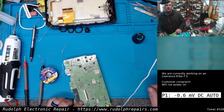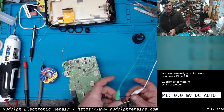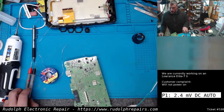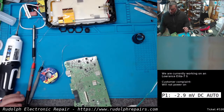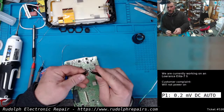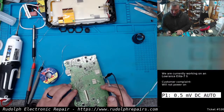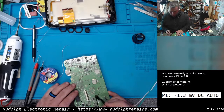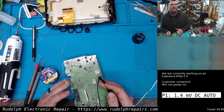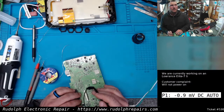So we're starting to inject voltage into the board. Now we're using, like I said, power supply going right to here. And we just took a clip lead, hooked up to our positive supply, hooked up to our tweezers, and we're sort of just probing, right? Places we know there should be 12 volts when the board's on. And the board's just acting strange. Where we're probing, we're not seeing any current draw.